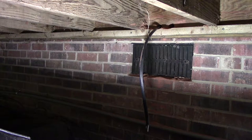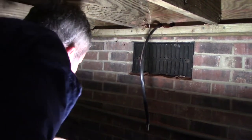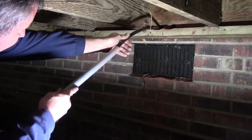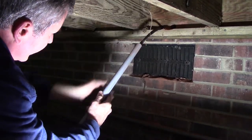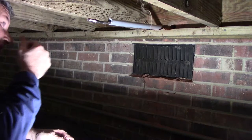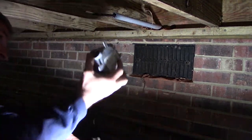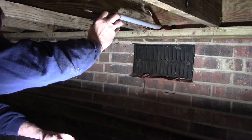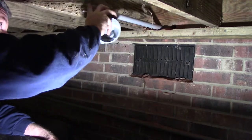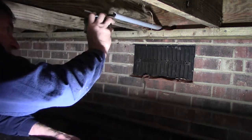So it's the next day and I've gotten as far through that as I can possibly get, so I knew I was going to switch over to Romex anyway. I've stubbed this Romex out through the wall. I'm going to take a short piece of conduit and shove it inside there and that will protect the wire — it'll go pretty far into this wall. I cannot get a straight shot all the way through and we're going to spend the hundred dollars for an inch-and-eighth masonry bit. That'll protect it, and then I got a round junction box — I will glue that on, get our other conduit into this end, and then run a piece of 2x4 support across here to support the box. It's got a gasket so it won't get any water in it.